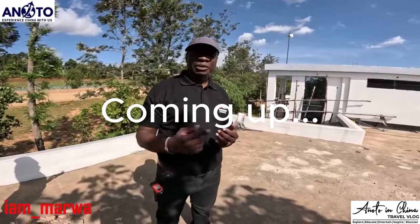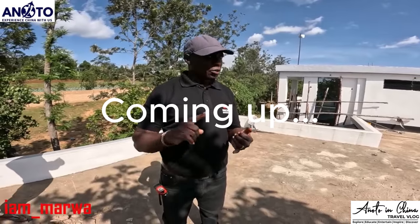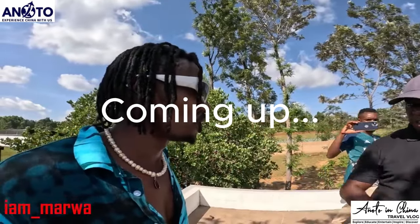Make sure you use the admixture in the initial concrete, and then do the waterproofing. Do the membrane. After the membrane, you do the screed, which is also waterproof, and then you protect it.